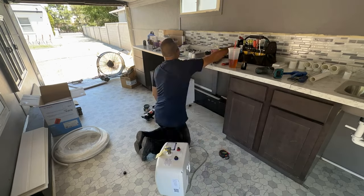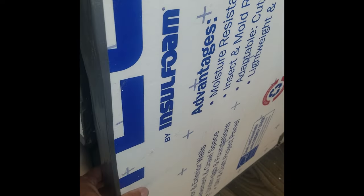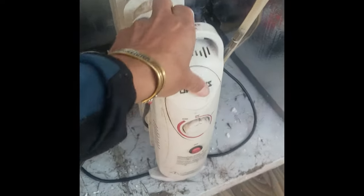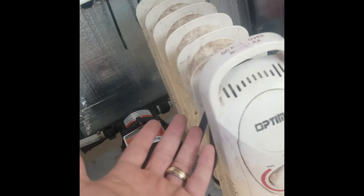If I have to choose between my gray water tank or freshwater tank being close to my sinks, I'll run my freshwater further away and keep my gray closer. For vertical tanks, they can bow over time so you may want to put in a brace to prevent that. Also, water heaters, water pumps, and espresso machines are most likely to freeze in winter — so I like to put those close together so I can run a space heater or radiant heater near them to prevent freezing.